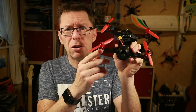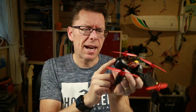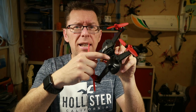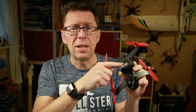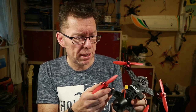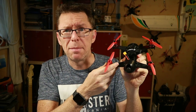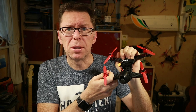The spec we have here: 1407 3500kV motors with quite skinny regular two-bladed props. I think the camera is potentially the weak point — it's a CMOS camera but at least has a 2.1mm lens. Inside there's an F4 flight controller, and the VTX runs Smart Audio. AKK came to prominence making Smart Audio compatible VTXs, so at least they've managed to put one in. The real key about this thing is the price — it's pretty damn cheap, but that's no good unless it flies decently. Let's pop this on BetaFlight and see what's going on.